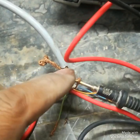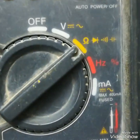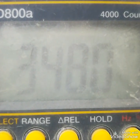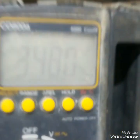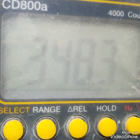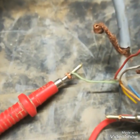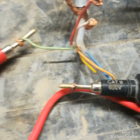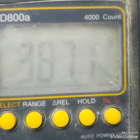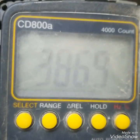Here, red and white are the output millivolt cables. We can check the resistance — it is 348 ohm. The excitation cable resistance is a little more: 386 ohm, 387 ohm, as you can see I am checking the excitation resistance.